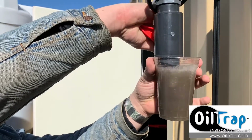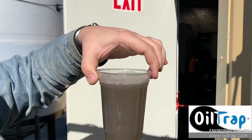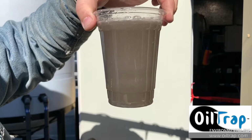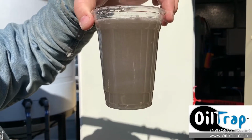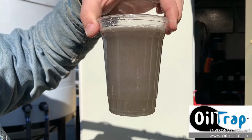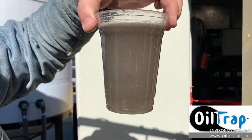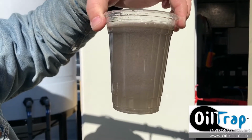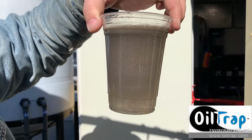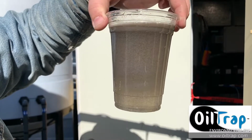Let me now take the time to demonstrate how electrocoagulation separates the solids from the clear phase. This is a visual that will explain how the separation process works in the tanks. Once the water passes through the electrocells and is energized, the solid particles take on a charge and bond together like little magnets and coagulate. Microbubbles are a byproduct of the process and lift the coagulated particles to the surface, forming a sludge layer, while the clear phase develops at the bottom of the glass.